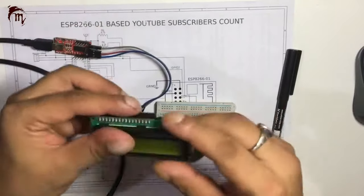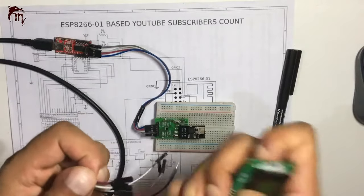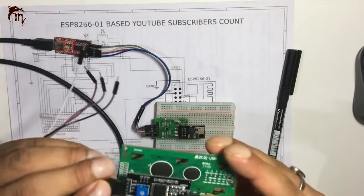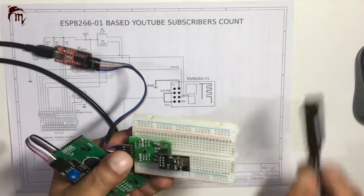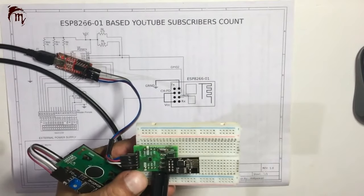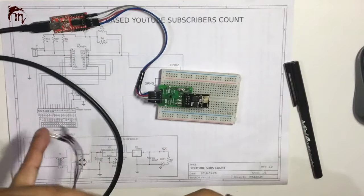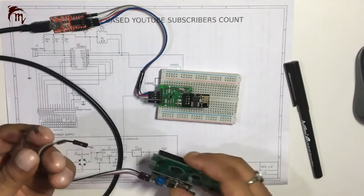Fine. And to connect your I2C LCD, I am using 4 connectors. Then here I am using your GPIO 2 as your SDA pin and 0 as your SCL, and SDA is your serial data line and SCL is your serial clock line.